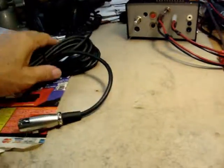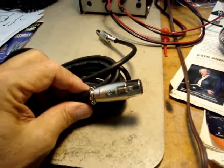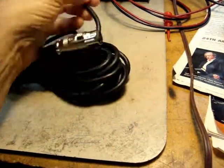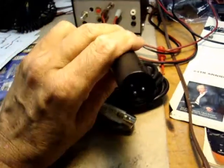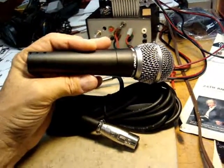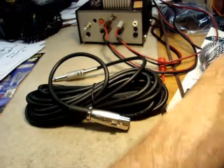I'm also going to look at the cable they give you with the microphone. Notice it's an XLR to quarter-inch adapter. That's an unbalanced — or balanced to unbalanced — adapter to a typical balanced mic, to duplicate that of a Shure SM58. This is wired funny, so let's look at that real quick.